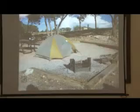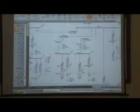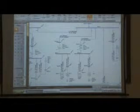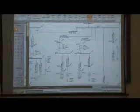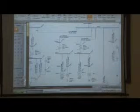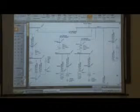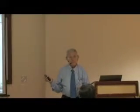A little aside, all of the transformers here are solidly grounded neutral, but they're not double. And the reason is because I didn't want to put in all the neutral resistors. So one of the first things you look at, and I would say if you're doing it, keep notes and say, number one, that they're all solidly grounded neutral, which means if you get a line to neutral ground, there's no impedance in the neutral, and you'll have a very, very high fault current. That's not wise. You may be stuck with it.